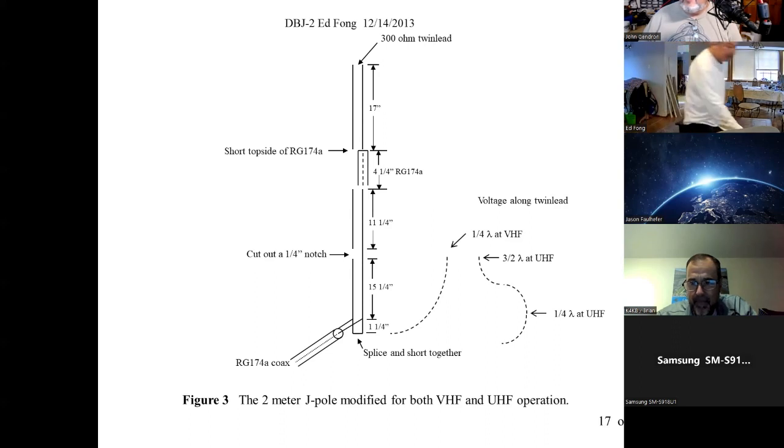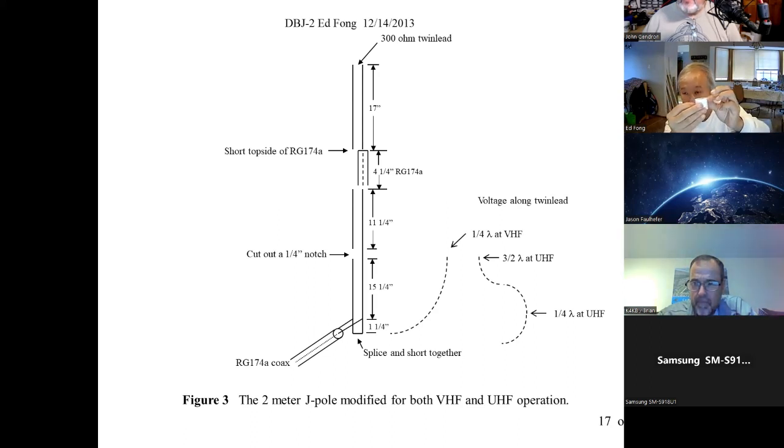What it is, it looks like a little balun that you hook at the end of the antenna. So it's got a PL259 with an SO239, but it's about this long. And we put two holes on the side with two banana plugs. And what we found is, let's say you're camping and you don't have that much space. You want all the antenna all in one.